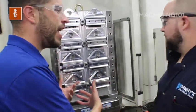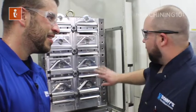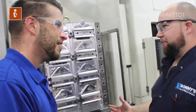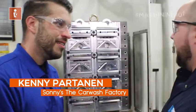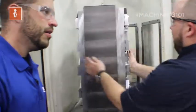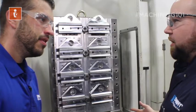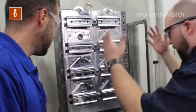So tell us how you came up with this fixture design. We were given a print from engineering with really tight tolerances — a thou and a half on this hole. Normally we're used to five or ten thousandths for a total tolerance. So we had to approach this differently, and we worked on getting a two-sided tombstone to maximize the width of this work envelope. We got jig plate material instead of working with vices or soft jaws, because that maximized the square footage and available space to put more parts on the entire work surface.